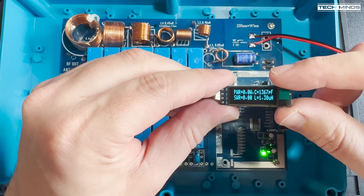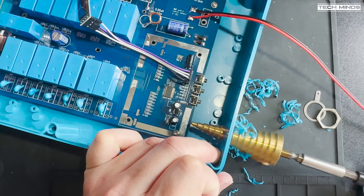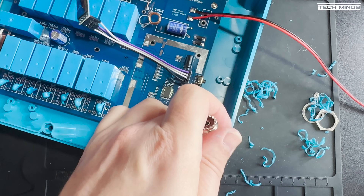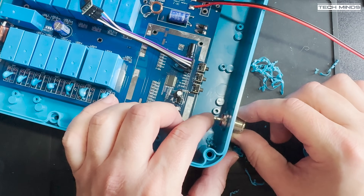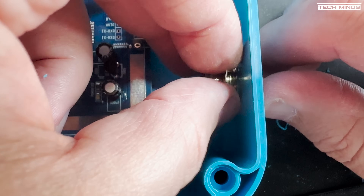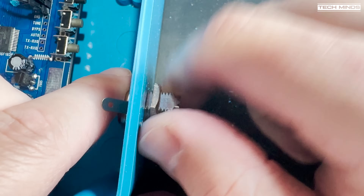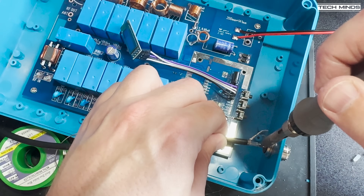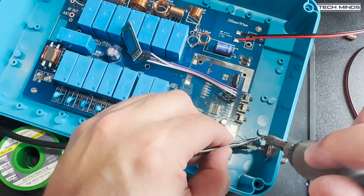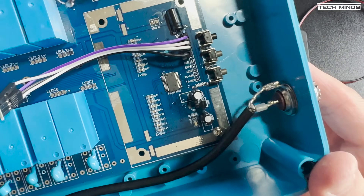Now it's time to hook up the input and output ports along with the power port. The SO239 socket I'll mount on the bottom — this will be the input to the ATU where the coax from my radio connects. Using my reamer tool bit made it easy to make the required hole for the connector. There's a little earth tag fitted on the inside of the box to attach the outer of the coax. This piece of coax didn't appear to be included in my kit, so I used a cheap piece of RG58 to bridge between the input SO239 and the input on the board.